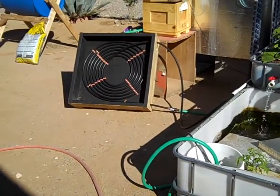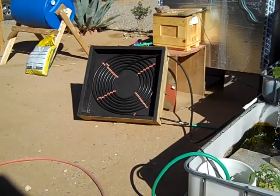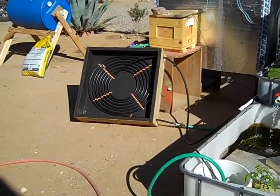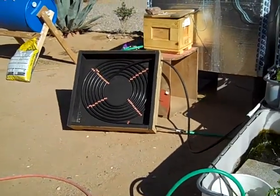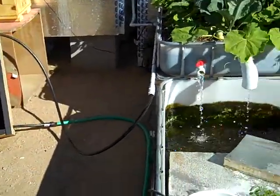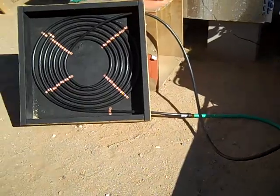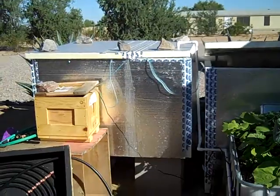So what I decided to do was make this little coil heater — just a little solar heater basically made out of half inch black drip irrigation tubing. I just put it in the sun and it can be moved around. It goes from the pump in through the bottom outlet, all around the coils, and comes out the top and goes up into that tank up top.